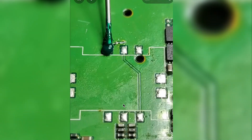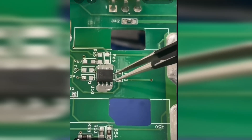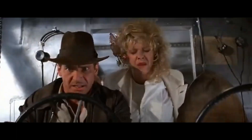So what to do? I could just limp along using RAM only, but if the boards lose power they need to be reprogrammed, and it also limits the amount of RAM available for data since the program takes up some of it. Ideally I'd like to fix this problem. We've seen all those videos where somebody expertly fixes a PCB under a microscope, right? Well, this will not be that, but let's give it a shot. Looking at the PCB, the swapped pins appear to be pins 2 and 5, so in theory I can lift those pins and solder bodge wires to the correct pads. It should work, right? How hard can it be?